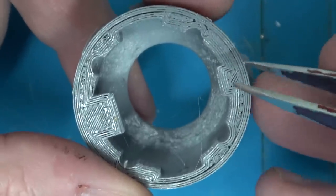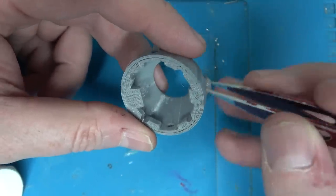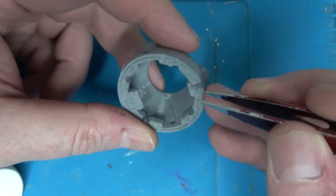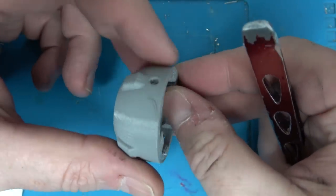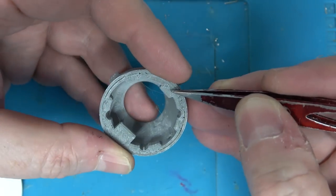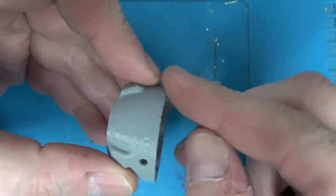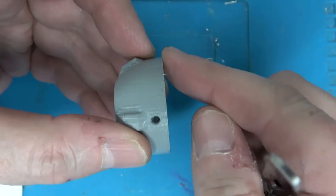The Z is probably a little bit more open than it should be, but a positive of that is you're not going to have really any elephant's foot at all — this is going to be quite flat with no compression on the end of it. As far as the layers go, you can see some ringing. It's less pronounced there, so it's probably a loose pulley that I need to tighten.